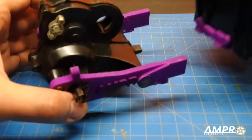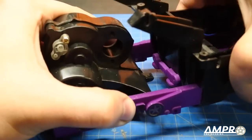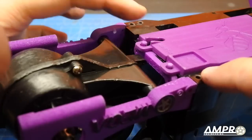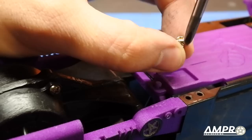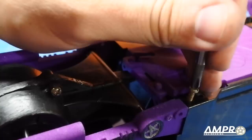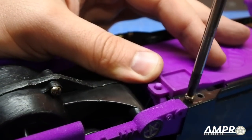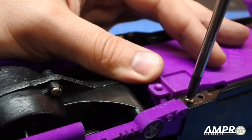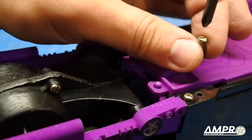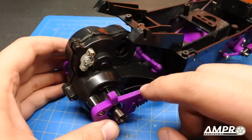At this point we can slip it into the slots on the back of the Hornet. Put the screws in here as you normally would. The holes just need to be cleaned out, not drilled — these are 2.5mm holes and are perfect for tapping these screws right in. Please do not drill them, just clean them out.